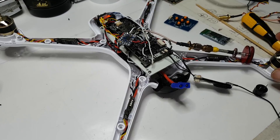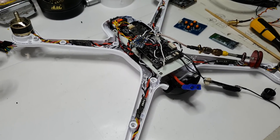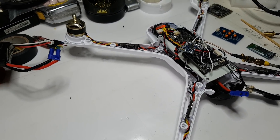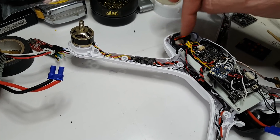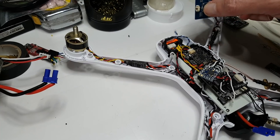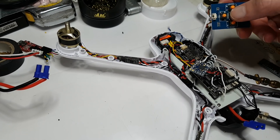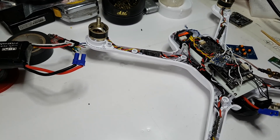I won't change the motors straight away - I'll go back to 7-inch props for longer flight times. Somebody left a link in my community tab about some carbon 7-inch props for the Hubsan, so I'll go find that link and purchase those - thank you to that viewer. I've got my RunCam Sparrow camera with the cable tucked out the way at the front. If you've had any image issues with the Sparrow, when you click PAL it's actually outputting NTSC and vice versa - just switch it to the other setting and it clears it up.